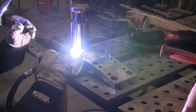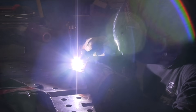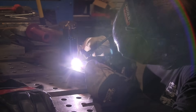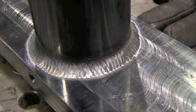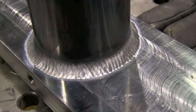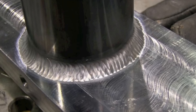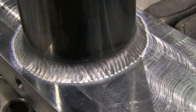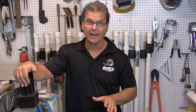For the first pass, then I came over it with a second pass at about the same heat — maybe five or ten more amps — just a nice little freehand weave pass, trying to make it look as nice as possible. I would have loved to walk the cup — it probably would have looked nicer — but it came out okay. The moral of the story: sometimes you can walk the cup and it's a great technique; sometimes you can't. It's great to know both techniques. Sometimes the metal gets super hot and a Tig Finger comes in super handy. I appreciate your support and I appreciate you watching. My online store is at weldmonger.com — we'll see you next time.